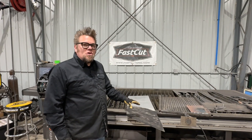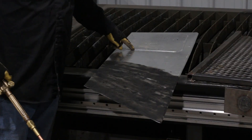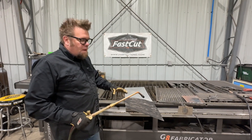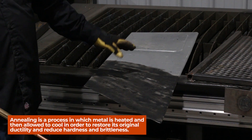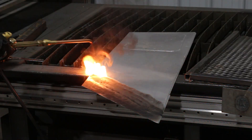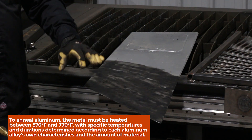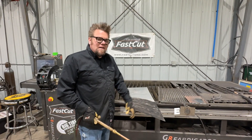This is an old trick that I learned from a sheet metal guy. When you're working with aluminum and you want to form it, you basically want to do what's called annealing. If we want to just put some beads on this aluminum, it's fine to work just as it comes into the shop. But if we were to build a gas tank or a fender out of this and we want to form it a lot, we want to anneal it. To do that, we want to heat the sheet to a very specific temperature — more importantly, a uniform temperature across the entire thing. By sooting it up with just the acetylene, as I heat it up with the rosebud, the acetylene will burn off at a constant temperature, ensuring the sheet is the same temperature all across it. It basically aligns the molecules at a molecular level and makes the sheet a lot easier to work.